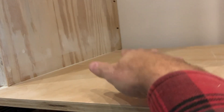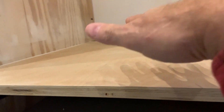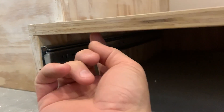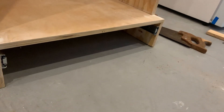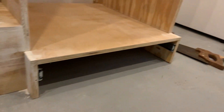Before doing all that I put the drawer on top to verify it was perfectly flat — I built it on my table saw. I confirmed there's no twist in it. Once I knew that, I could put these tracks in and just match them to the cabinet on both sides. The left and right will be on the same plane. If they're not on the same plane the drawer will get tighter the further you pull it out.